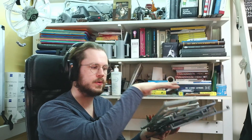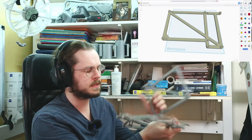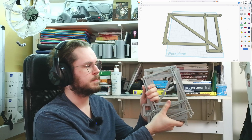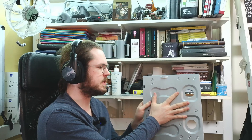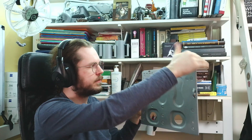The hardest part of the project was the 3D printed support that holds the motherboard onto the aluminum plate. Initially I tried to design it myself using TinkerCAD — I went through quite a few iterations measuring by hand, ruler, and caliper, but it ended up being way too much work because the pieces are rather big and the tolerances are quite small — we're talking one millimeter max. So I decided I could possibly use the back plates already existing in the computer cases, which are normally held in place by rivets.